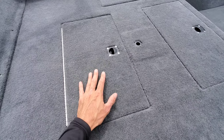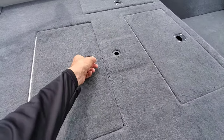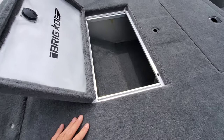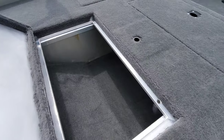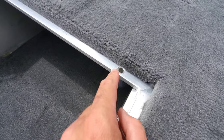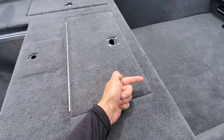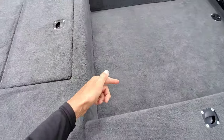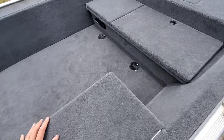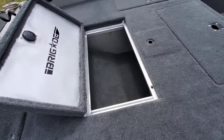He makes them for carpeting, hydroturf, or sea deck applications. They come with the hinges — you drill your own hole, mount your latch, and it's got a track inside to allow water to channel. It's a dry hatch; water channels there and then runs underneath through that hose. The hose actually goes through the channel I created inside this hatch, then down and into the deck. There's a factory water drainage in this deck to direct everything back to the rear of the boat.